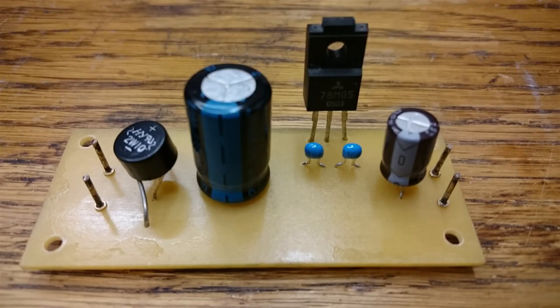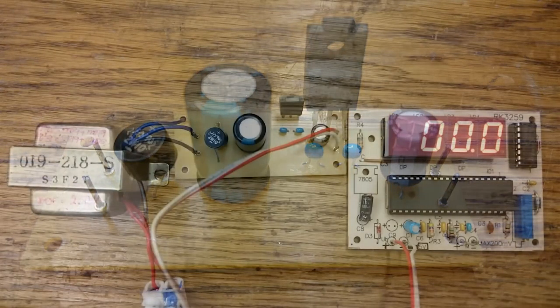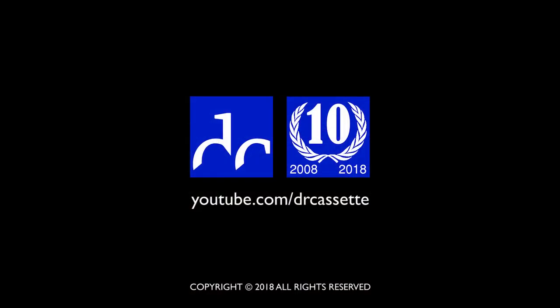This is a 7805-based, 5-volt regulated power supply circuit — not really worth the effort of designing a circuit board, but this was mostly just an experiment. As expected, the circuit works flawlessly. Of course, the complexity of circuits is rather limited by this easy method. Since writing this article back in 2016, I have successfully tried the toner transfer method to copy layouts designed on the computer to the copper-coated board. Thank you for watching.